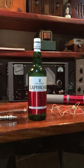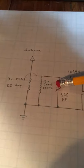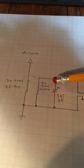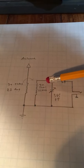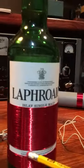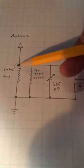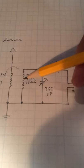Normally with crystal radios, you have one coil. I'll show you on the schematic, and you have an antenna connected to one coil. You get no selectivity or sensitivity. It works way better by doing the second coil. And you know, they're not electrically coupled, they're air gapped. So antenna comes into the first antenna coil, the 30 turns, induces a signal onto the second coil.